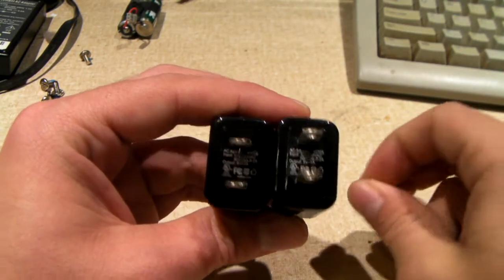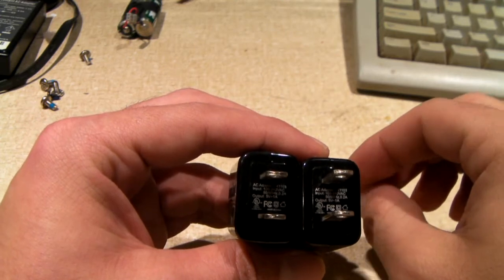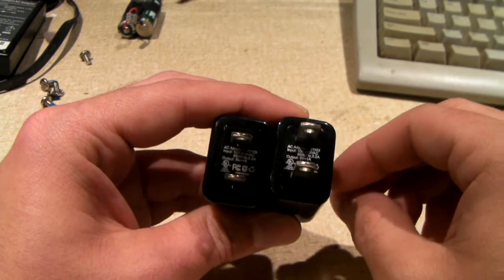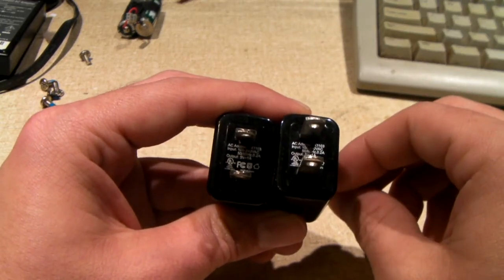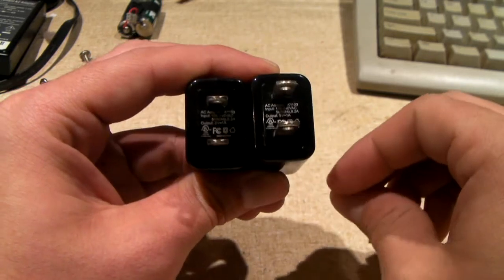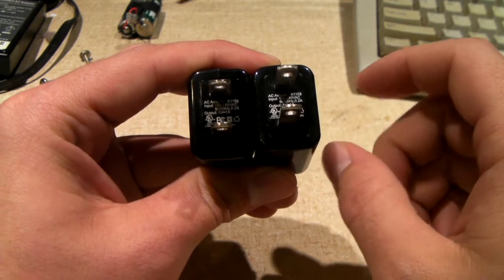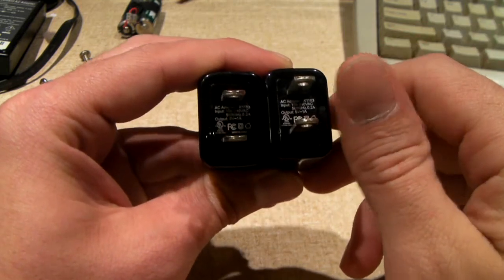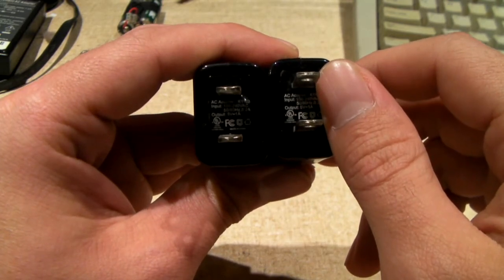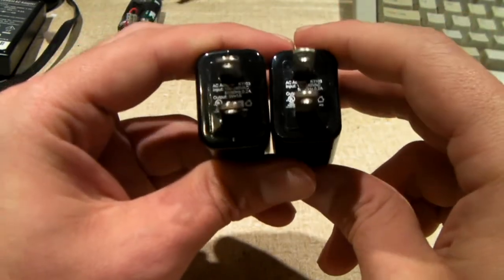Essentially, one problem you may experience is when you get a phone call, your phone may fail to ring and it may reset, your device may restart. Sometimes if you pick up the phone and try to make a phone call, it'll struggle to stay off the hook. All sorts of random things can happen. Anything that causes your magicJack device to need more power from its power supply, you may experience weird issues when these decide to give up. Now, sometimes they just give up outright and quit working altogether.